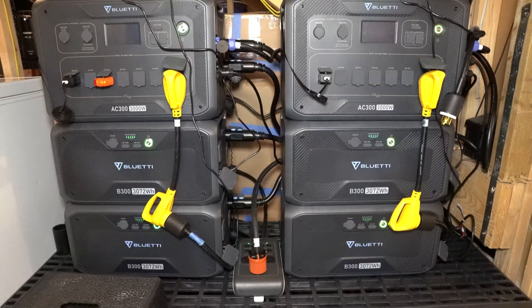However, if you have the transfer switch that's official from Bluetti, the smart home panel, or a Reliance X series or a Generac home link series that switches the neutral cable from the grid — basically having no direct path back to the main panel's neutral line — then you have no bonded neutral, and these units are 100% floating.